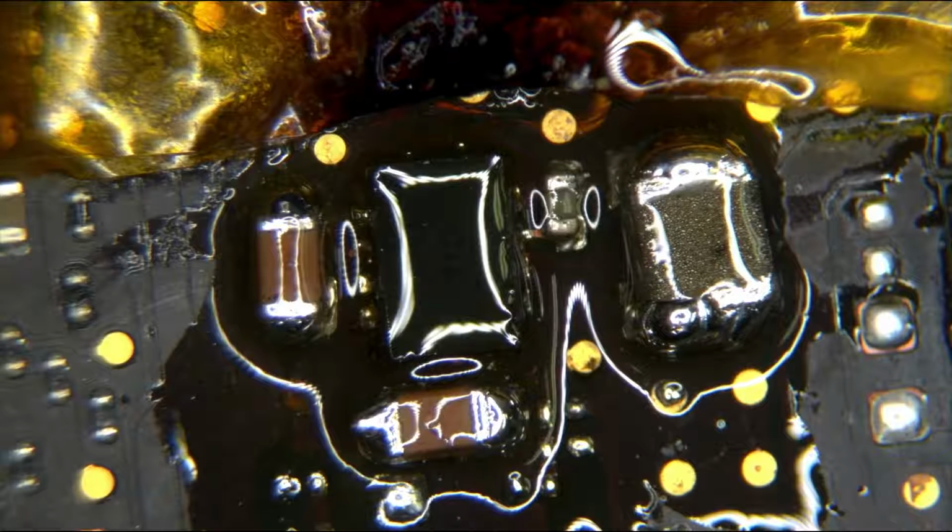I'm destroying a Retina motherboard right now. That's no good. I removed an inductor. So there's a 3.4 volt power supply that was missing. That's where the spill was on the board. There's a little piece that attaches that to the rest of the computer. So I removed that little piece because I want to see if there's something wrong in front of it or if the thingy that makes 3.4 volts is broken.